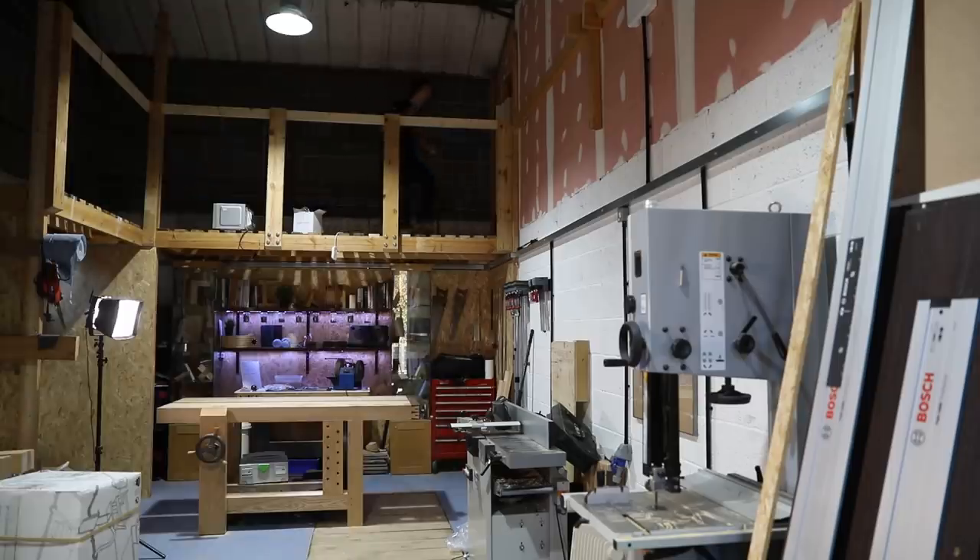The solution is my mezzanine floor, which came with the workshop when I moved in. I'm thinking if I get the extractor up here and the tubes poke out here, it's at the perfect height for the tube run to go all the way down and feed to the machines. It means the hose won't be violently kinked coming out of the extractor, the extractor is out of the way. The only downsides are having to come up here to change the bag, and to turn it on I can just jump on my workbench and reach the switch.